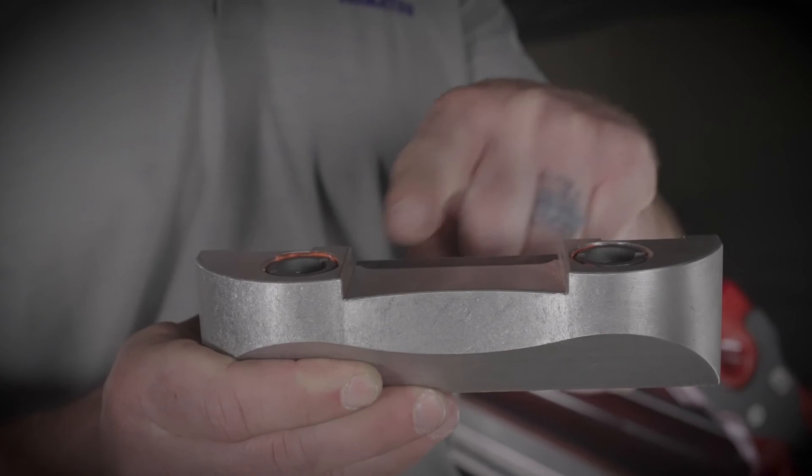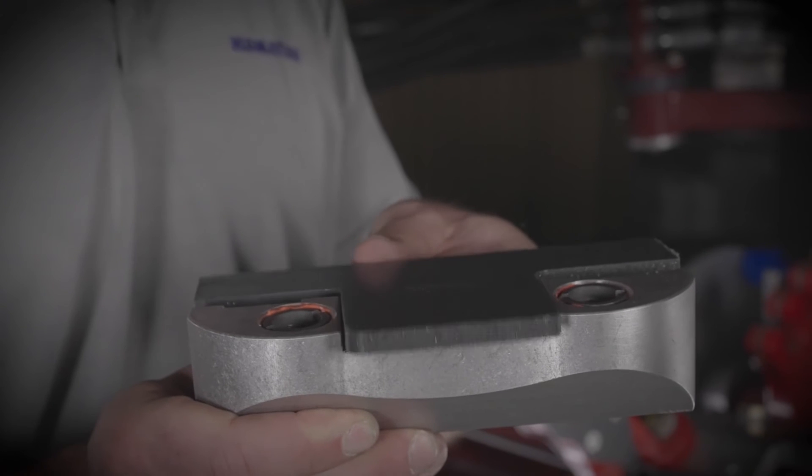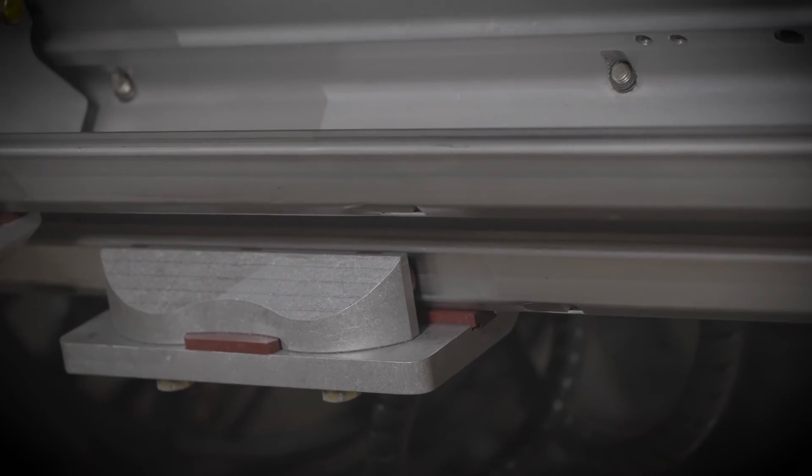The aluminum holders also feature a locking provision for the lower wear strip, preventing it from any sort of movement. You have double retention preventing the wear pieces from being pulled out of the holder, which would cause damage to the rail.